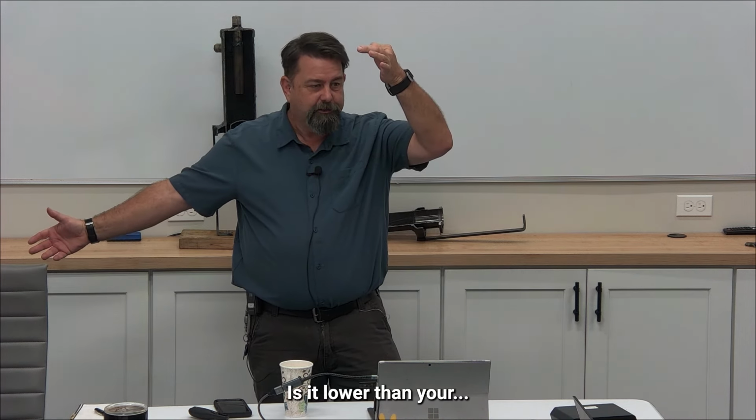My evaporators are still using all the refrigerant they were. So yeah, it's going to be lower. My pressure is going to start falling on my liquid that's coming out of my A8 valve. Well, I just said 150. That's the whole point: stay above 150.